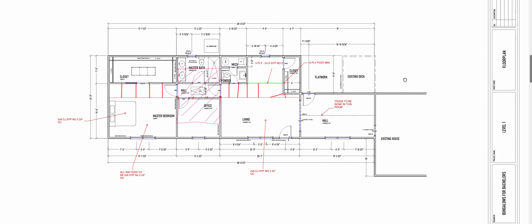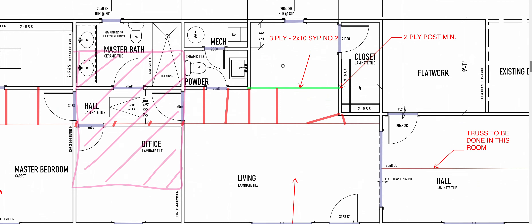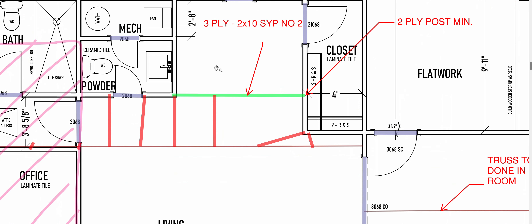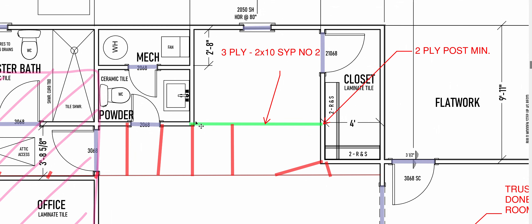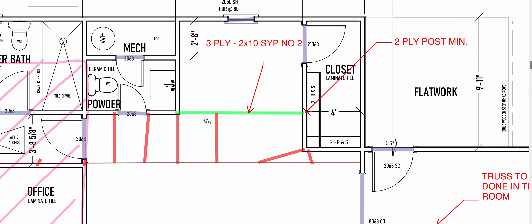So what are we going to do for this one? Well, the first step when you're finalizing your design is you want to make sure that any beams you've put in, you know where to put them. In this case, we know this beam was supposed to be aligned with this wall, so we don't have to put a dimension here. Because when you go to frame this and set this up, you already know where these wall's dimensions are. You already know what's going on here, so you just follow the dimensions on the plan and put the beam where it's supposed to go.